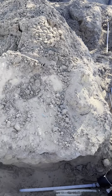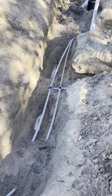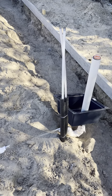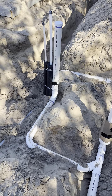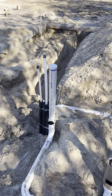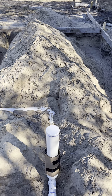That's how that'll trim out underneath the kitchen sink. Then the Uponor comes over, tees off one last time and comes up into the wall for this tub-shower unit, which will be roughed in in the wall. Then comes over — got a half-inch hot coming up for the sink, three-quarter cold because I'm going to tee off of that in the wall for the lavatory and then come over and get the toilet.